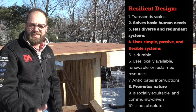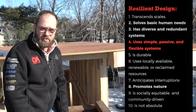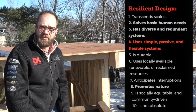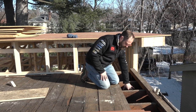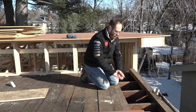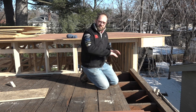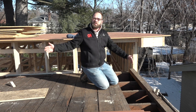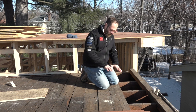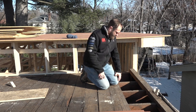That's pretty darn close to R80. It's more than enough, and the house should be pretty comfortable. We're going to insulate between the ceiling and the subfloor here, but this is not the finished surface. Over the top of this is all the framing, another layer of our Zip sheeting, roof decking — that's all going to get taped. So our air barrier is going to be up here, and then we'll actually have a small pocket of dead air space, impossible to vent. And then we'll have about R80 sitting below that.